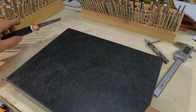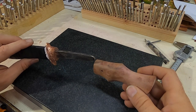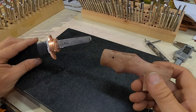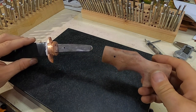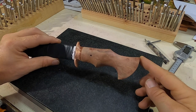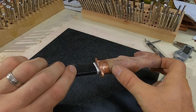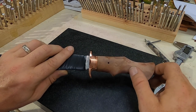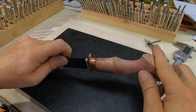That went pretty quick — I know the video was sped up. But because we went and ground those edges and corners, that process is what helps expedite the rounding and shaping on the slack belt. It does go that quick. Let's see how this fits up. That looks pretty good. We have a little bit of an edge here which I still wanted to keep. So what I am going to do is go back by hand and round this edge to meet the spacer, and that's going to give us our museum fit.